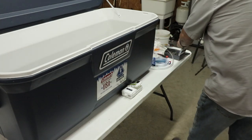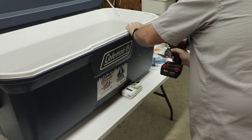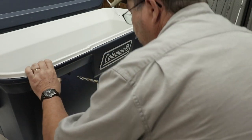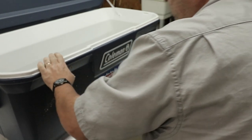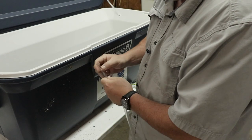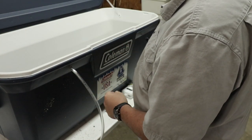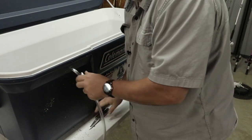We're going to get around that by using the 7-16ths tubing. We take a drill with a 29-64ths bit. As you can see, the insulation was flying out of there — that's the insulation between those two layers. Then we're going to take our tubing and force that through there. It's going to fit just a little bit loose, but that's okay. We're going to cut a piece and run it through each hole.